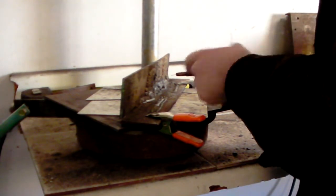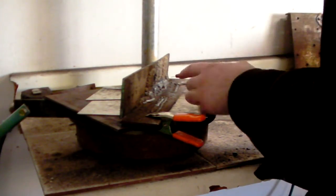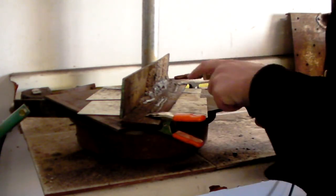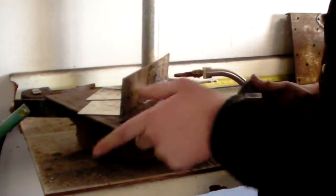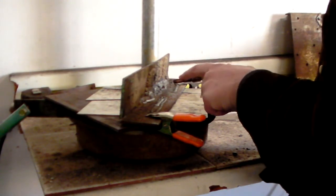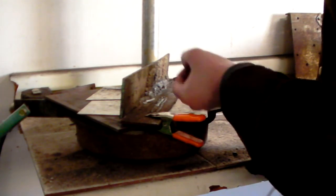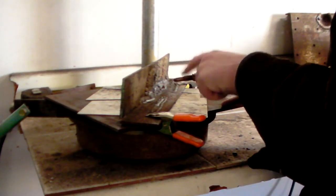Now what I think is going on is, when you get welding, the wire heats up and then expands. And I think it's getting a little tight in the nozzle. So I just recently, this is advertised as an 030 wire, 0.030. It runs on settings for 0.035. And I've got a 0.040 contact tip on here. So the reason behind the oversized contact tip is as that wire gets hot and starts expanding, hopefully it won't lodge itself into the contact tip and not feed correctly.